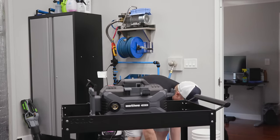The hose, if you buy it unterminated by us, know that you're going to have to be a real man, not a baby. Go get your wife. She'll help you. But this has to be torqued down. These threads are purposely stout. You have to torque the crap out of this. If you don't have a vise, then you're going to have to learn how to lay a wrench on the bench and push against it. Or like I said, go get your wife. She'll do it for you. These have to be tightened down, otherwise you're going to get leaking.